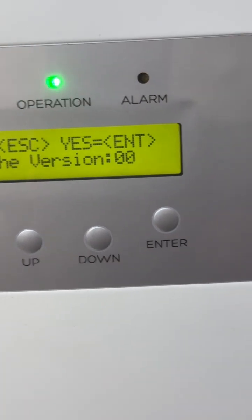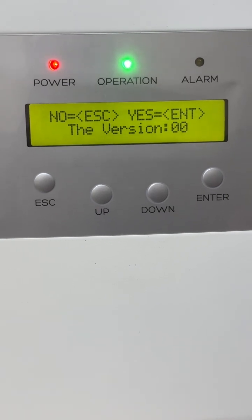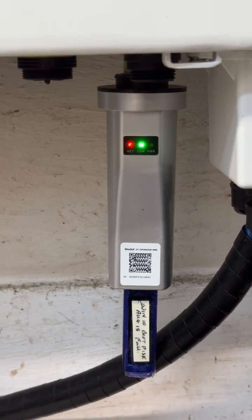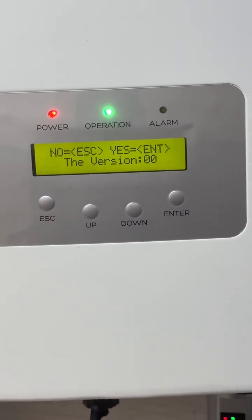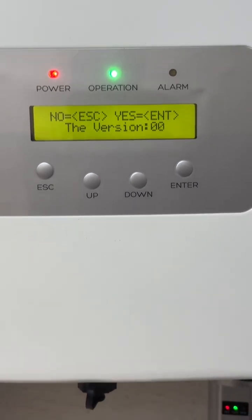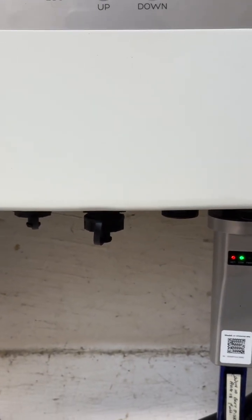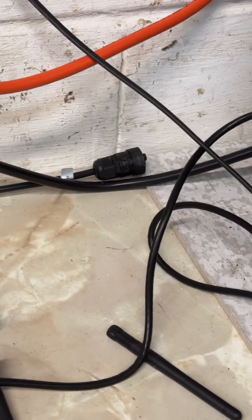This has happened on the second inverter now — I can't get this DSP update to work. I do suspect it's the updater stick that's faulty and not the inverters, or it's just a big coincidence. I'm sorry for all the trouble, but at least I've made you this video so you can tell me if there's anything else I can do differently. Should I have kept those cables connected? In your instructions it says to remove any communications cables, so that's what I've done. Thank you very much.